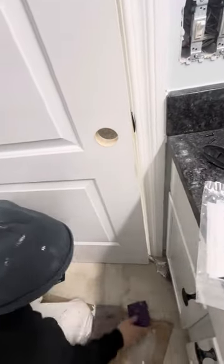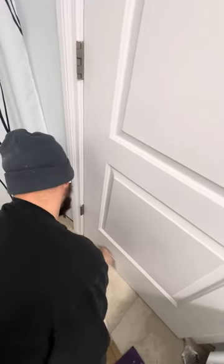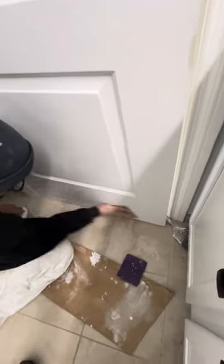These doorknob holes are always something you want to hit with something a little bit more aggressive, especially if you're trying to get an older ring out doing a different doorknob. You can see I'm moving pretty quickly through this. You don't want to spend a ton of time on something unless you're getting paid to — this is just your average everyday door. Making sure I hit every surface. Down here I got some heavier dots. My 220 kind of knocked a little spot down. It could have been drips when we did the ceiling, or just some spatter from when they sprayed the doors. But if you bust them down, usually they'll go away.